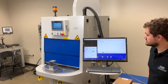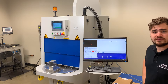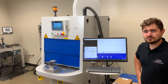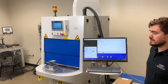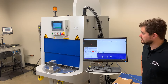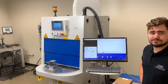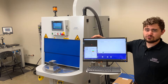Let's take a look at the Industrial PC. The Industrial PC comes with our proprietary Weld ProLite and ProSet 3D software. This is how you create your laser welding contour, make adjustments to that contour, start a new part, or make adjustments to the laser welding speed. Also included is our data collection software — all welding data is gathered and serialized in this software. Finally, you'll be able to monitor the welding process with a visual camera.